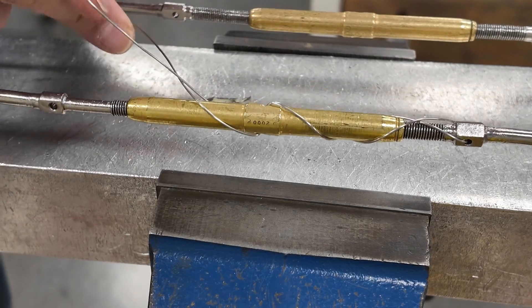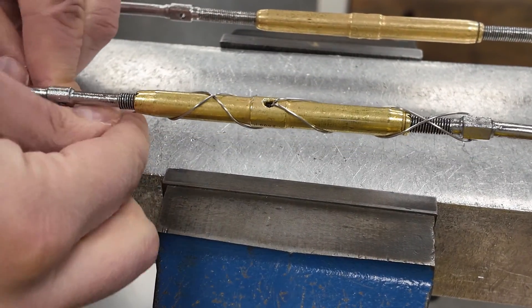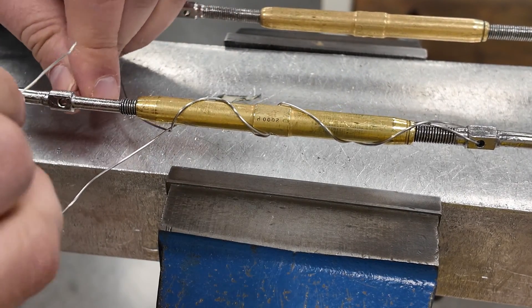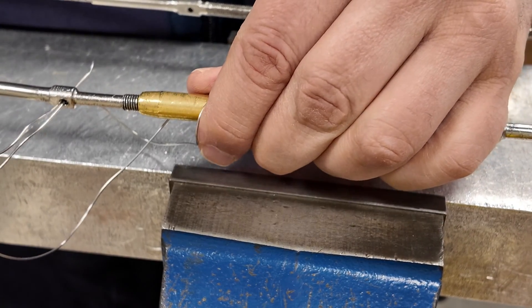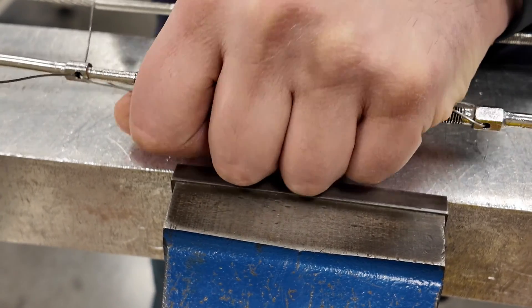Do one cross on this side, another on the bottom side, and then at this end of the terminal, the pieces of lock wire go in opposite sides of each hole. When tensioning the lock wire with your pliers, be careful not to kink it.